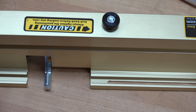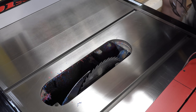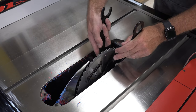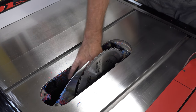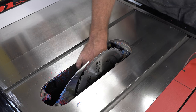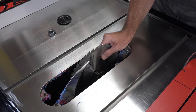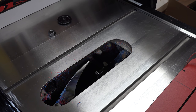Once you've got those pins set, the next thing you want to do is install your weapon of choice in your table saw. For me I'm going to be using a dado blade set to the quarter-inch configuration, which means just your outer blades on your dado blade set. With this jig it doesn't matter what thickness of blade you have — the jig will work either way. Get your dado blade installed and then we'll move on to setting the bar in your miter slot.